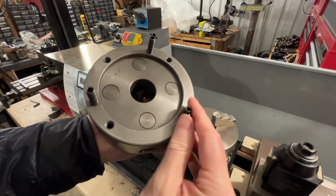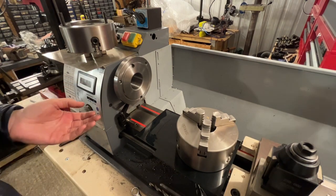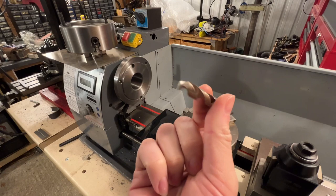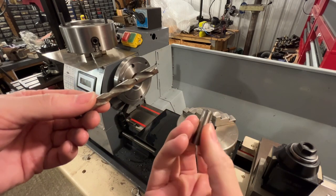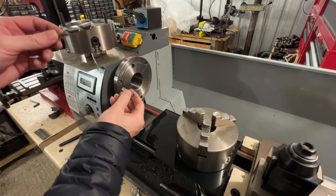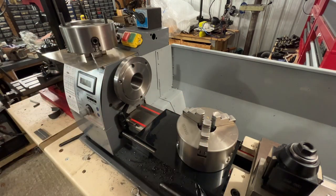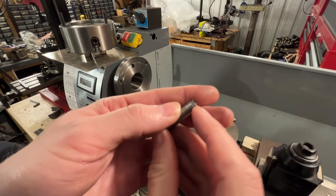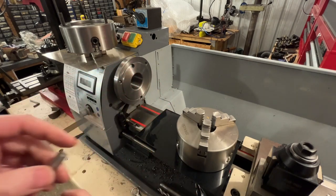Basically what I did was drill two extra holes. To get them lined up perfectly without messing up my transfer punches, I chucked a drill bit in the lathe, put some paper down, and cut a little section off using the slitting saw — it was a 9mm drill bit — and then used the lathe tool to turn a small pip on it. It did break on the first strike but there was still just enough to transfer punch the second hole.